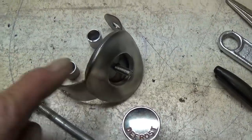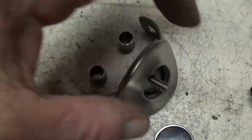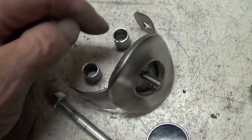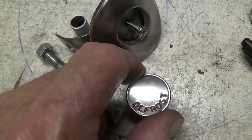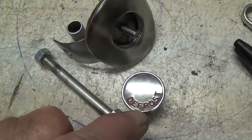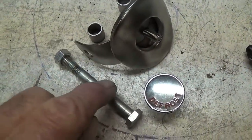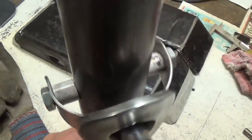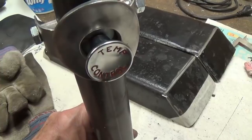Here's a close-up of the parts I'm using to make the kneecaps for the legs: a great big heavy washer that is bent to match the curvature of this one-inch wide metal strap, spacers that go on either side, and then for a nice knobby knee, a couple of automotive control knobs that will screw on to a stud welded in the middle. It's all held on with a 5/16 inch bolt. Here's one that's together — you can see it's a knobby little knee. This particular one is for temperature control.